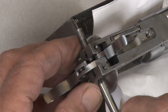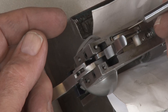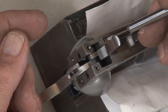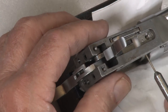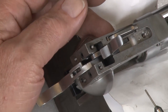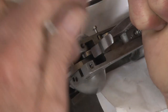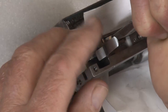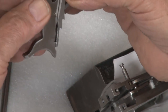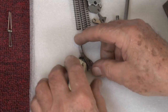You can push out the hammer pin. Now you can't push the trigger pin out until you depress the loading gate spring, which goes in a groove on the trigger pivot pin and that's what holds the pin in place. Usually I push this up like that — that unlatches it from the loading gate on the far side. Then you can depress this. There's a little tool made to depress it, but this seems to work pretty good. Here's your hammer and trigger assembly — it comes out just like that. When you go back together, you can put it back together the same way.